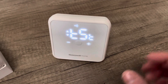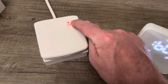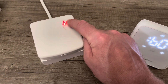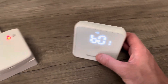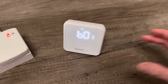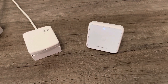Once you've done that, scroll across and leave it in boiler mode. On the receiver, press and hold the button for about 5 seconds until you get the slower flash, then let go. Then on the thermostat, go back to boiler. Make sure the two devices are about 2 metres apart. Press the middle button and see if it pairs.